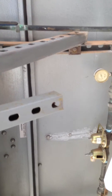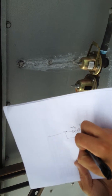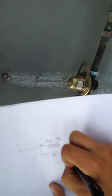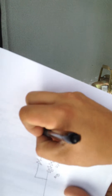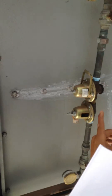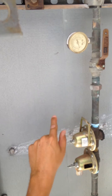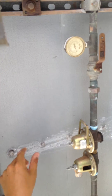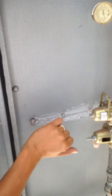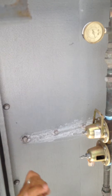So right now this is what we got. What we want to do is put an elbow there, come here, put another shutoff, and put here — so that's our bypass. What that does is if I need to fill this pump, I put a T here, come off with just a ball valve, a regular ball valve, and basically bypass this bad boy.